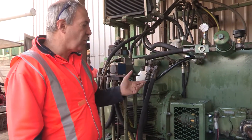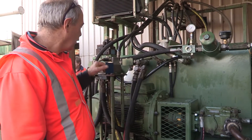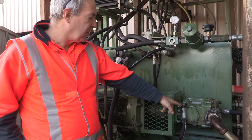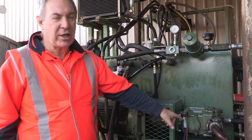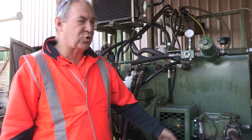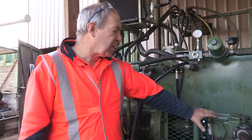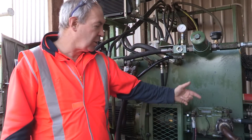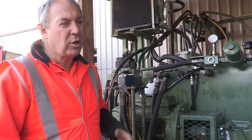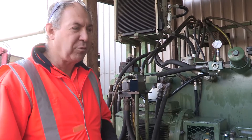The resultant damage of this whole system — there are two pumps on this one, with one on the other side you can't see — the servo valve was damaged, we've pulled off the pump and we've got to put a new rotating group in the pump because the fine metal absolutely destroyed the rotating group and the swash plate. So there's a new pump, three valves and a new cylinder, for what potentially could have been a preventable problem.